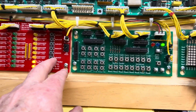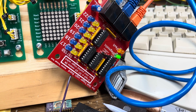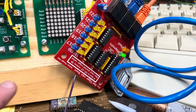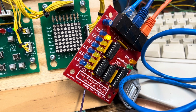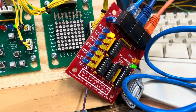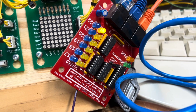Now I'm going to press this special solenoid switch, hold it in, and that's all that happens. This piece of hardware is accepting the special solenoid switch input and then sending a one-shot pulse out to the coil. You'll see the yellow LED light up for the switch input and the blue LED light up as the output pulse goes to the coil. Now if I hold the switch down, it's still indicating that it's getting a switch closure, but it is not sending a pulse out to the coil. So the scenario where the coil heats up and eventually you end up with a burned-up special solenoid section on your $450 board cannot possibly occur.